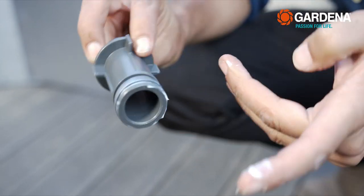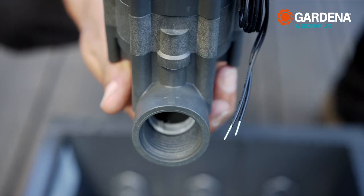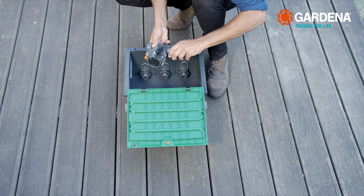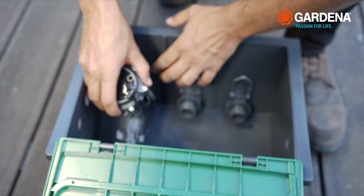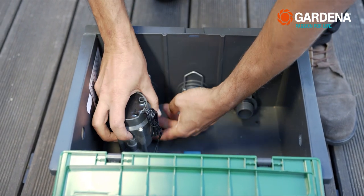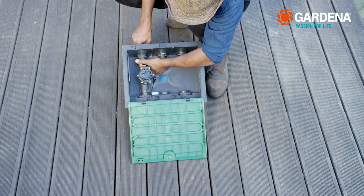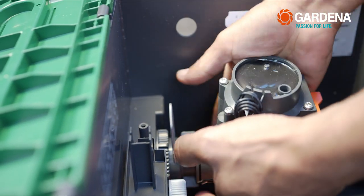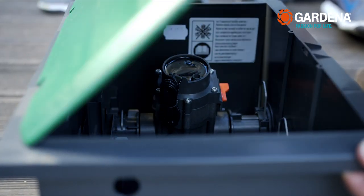Plug the connections into the valve box from the inside and screw them to the valve box from the outside with the screw nuts. To mount the valve box, insert the long telescopic tube all the way into the exit side connection. Then screw the short telescopic tube into the opening of the irrigation valve — the arrowheads on the irrigation valve point in the direction of flow. Next, insert the irrigation valve with the short telescopic tube into the distributor exit of the valve box. Screw the long telescopic tube into the irrigation valve exit and fit a clamp into the hole.